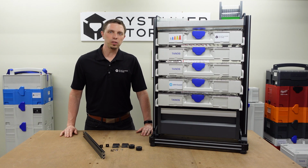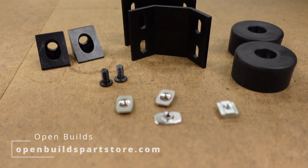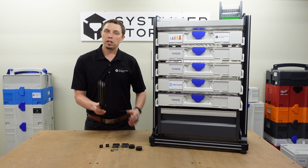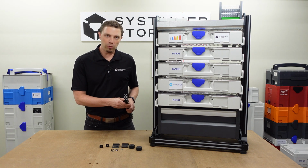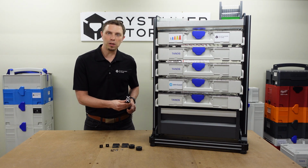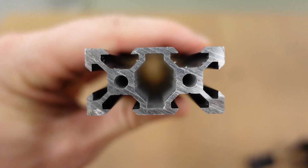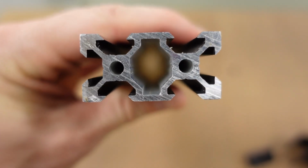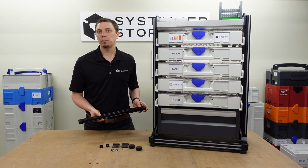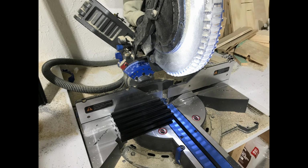The SYS Tower is built out of OpenBuild's components. I'll have links in the description to the various components that you can get from their web shop. The main component is this extruded aluminum profile. This one here in my hand is a 20mm by 40mm profile, and it gets its name V-slot because of the shape of these slots that run down along the rail. These rails can be bought in lengths from 0.5 meter, 500mm, up to 2000mm, or 2 meters. You can cut this rail with a miter saw and a good blade.